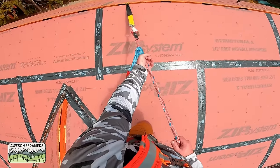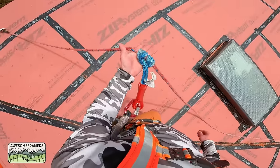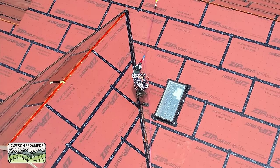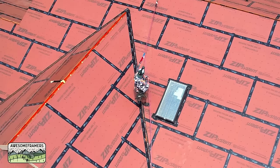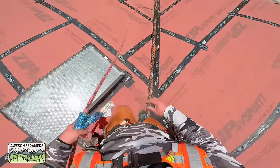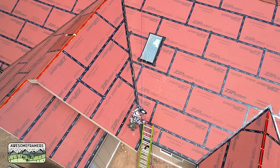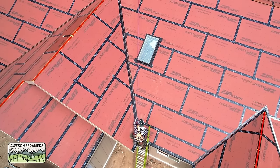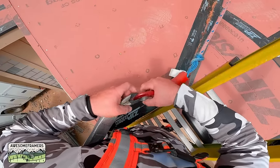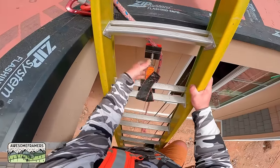Hand underneath slides up, opposite to slide down. Once I have the desired length, just let go. That would be fall restraint, by the way. I can't go anywhere. But you see how the knot grabs. Easy to use, fast, super light, no metal parts banging around in the middle of my back. Once that rope is set up, we just leave it there. Who knows who needs to be back up here. Now I'm disconnected. Of course, the ladder's connected.